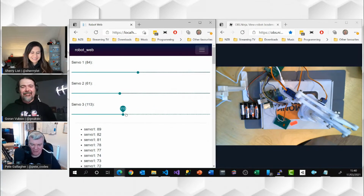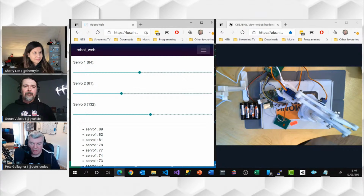You can see here, this Servo 3 is the software PWM servo. Now, if you don't set that high precision timer option on that, then you get it kind of looking like this, where it moves in big steps, and it's terrible. But if you turn on that high precision, you can see that is pretty high precision at that point. That works quite well. I like that. So that's cool. So I'm going to stop that.